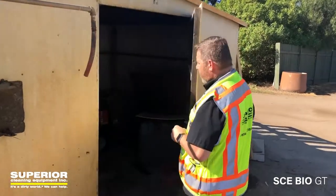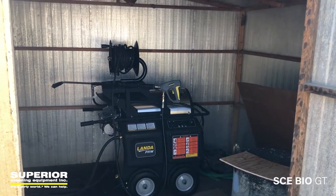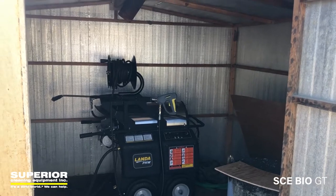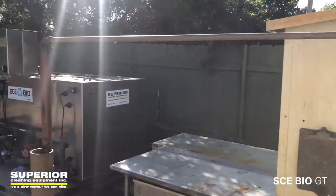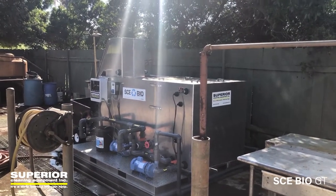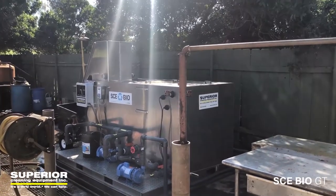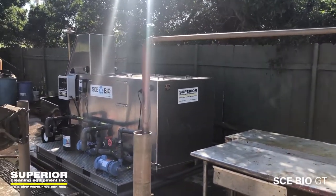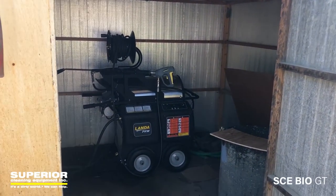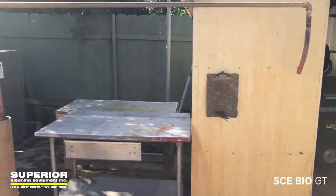In addition to the brand new water treatment system, they did a full upgrade and got themselves a brand new Leland PHW — a 3-gallon-per-minute, 1,000 PSI hot water pressure washer. In a lot of systems we set up, they're using a 3-gallon-per-minute cold water washer, but this hot water unit is used for deep cleaning tractors, removing grease, and so forth.